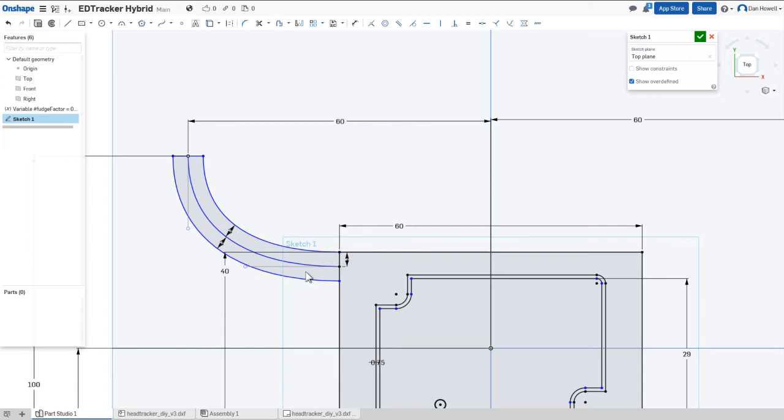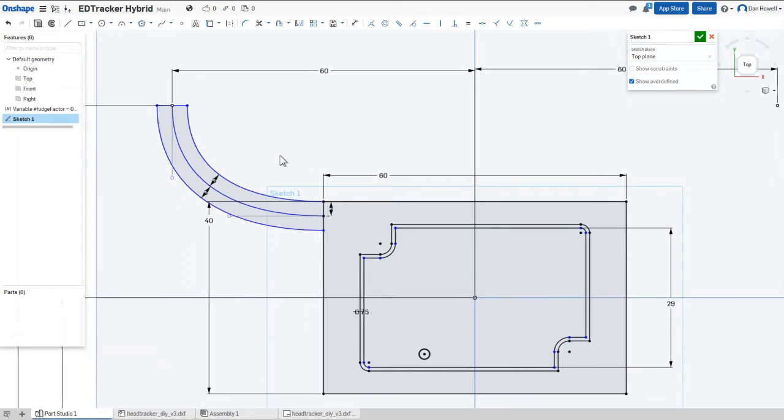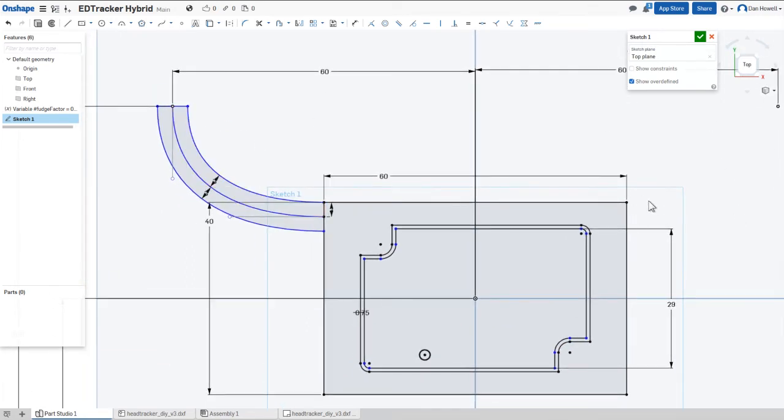What I'm going to do is define one side, and then I'm going to mirror it onto the other side, because obviously this should be exactly the same dimensions on the other side. Okay. Oh well, what we're going to want to do, we can use that line as the cavity. We can use that to extrude a cavity down the middle that the wire's going to go. But we'll want that wire to root in here somewhere. So the idea is I'm going to print this box in two halves. Like, imagine it sliced across the middle. And you bring the two pieces together.